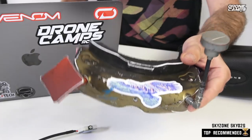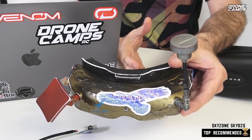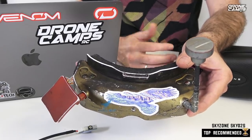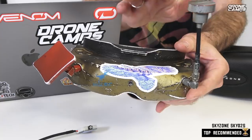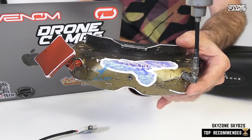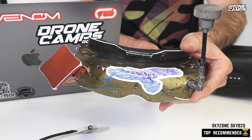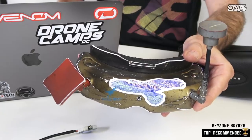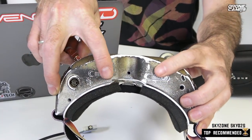As far as battery goes on this one, you can run these up to about 12 volts — limit these to a 3S battery, don't put anything higher than 3S. The 3S 2200 is my battery of choice. You can put the battery in your pocket and get that weight off your head — the day I did that it really changed my flying, it felt so much more comfortable and lightweight. The good news is these goggles work with all different types of transmitters out there, including Fatshark, DJI, Walkera, Boss Cam, ImmersionRC, RunCam, and AKK transmitters.